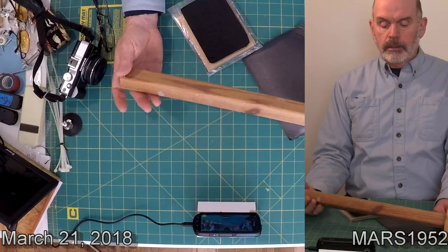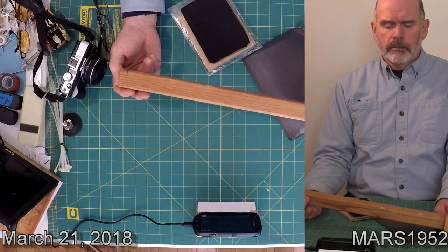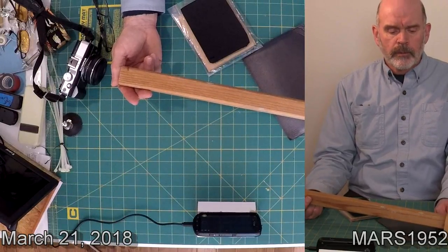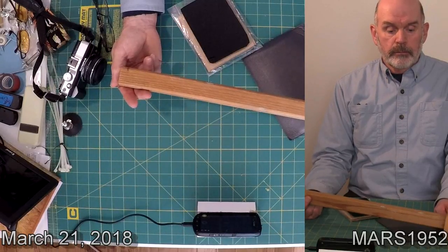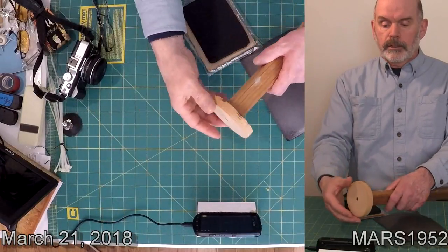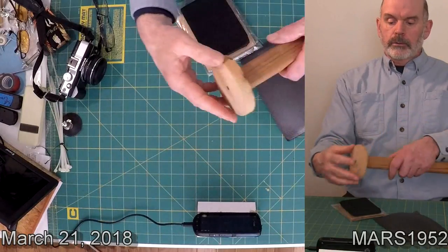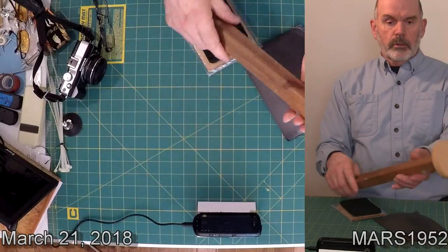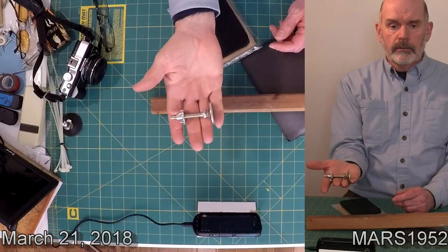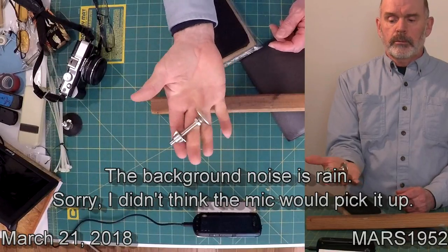Here's how to make your own rack. You could probably use a 2x2 — I don't know if they come in 10-foot lengths. Most 2x2s are going to be 8 foot; your ceiling is going to be 8 foot 2 or 8 foot 4 inches depending on your house. If it's longer you just have to use a different piece of wood. I had a scrap piece of wood laying around — just drill a hole in it and countersink a screw. I left it in so it would pivot; that's important for later. Then you get one of these — these are leg levelers or furniture levelers. You can get these in boxes of two or four usually at Home Depot, Lowe's, or Amazon.